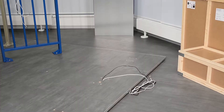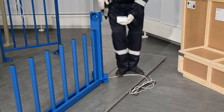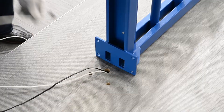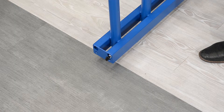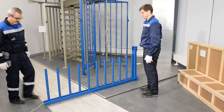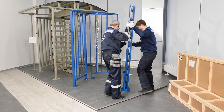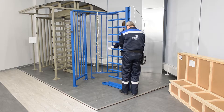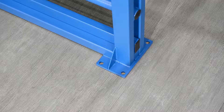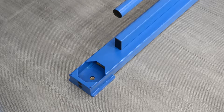Unpack the barrier section from box number 5. Take elements of the bottom rotation unit out of the barrier section: supporting flange, flooring insert, and slip washer. Route cables through the bottom hole of the barrier up to the top hole. Cable leftovers at the top hole must be 80 cm to 1 m. Mount the barrier section on the holes with anchor bolts. Use four M10 anchor bolts to fix the flange of the barrier section — do not fix tightly for later adjustment. Insert the supporting flange of the rotation unit and fix the flange and the barrier section with barrier arms using M16 anchor bolts.